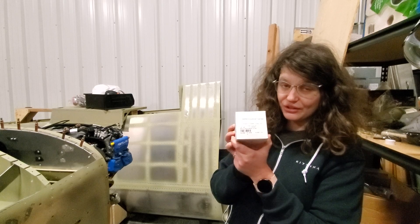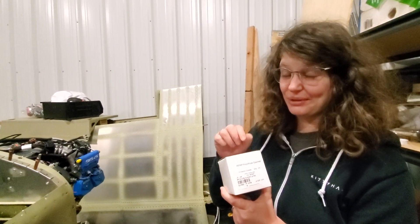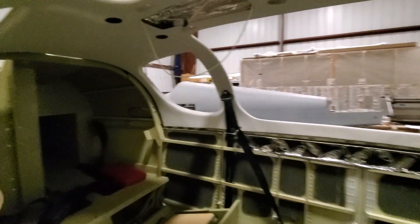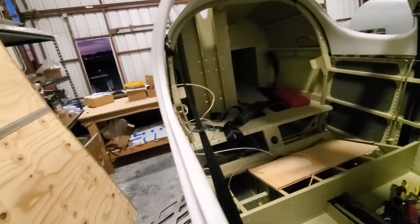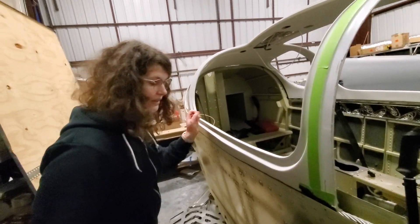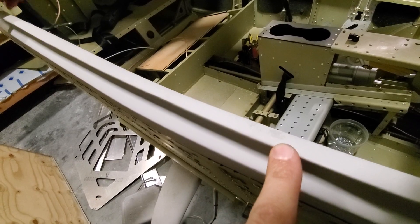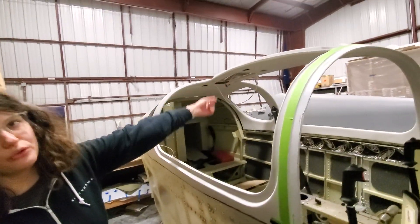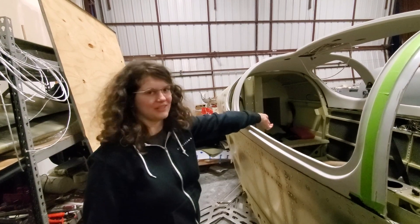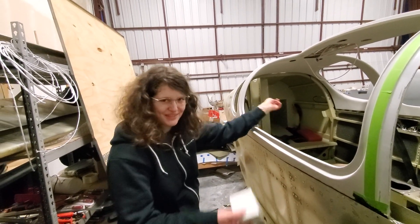What worked much better were RPM poly wipes — you can get them on Aircraft Spruce. They're ungodly expensive, and this is not a sponsored video, but they work really well. The problem is they're a bit aggressive, so don't scrub super hard. In one spot we actually rubbed the paint off, but you can always touch it up later. What really matters is that you don't get any Sikaflex on the ceiling, because that's the hard part to touch up. It is a bit of a messy process, so just forgive yourself if you end up getting Sikaflex on the inside.